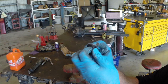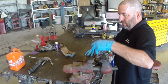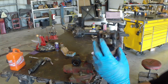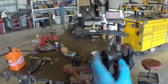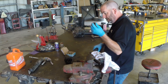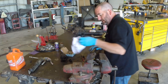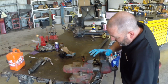One of these cups is filled with little needles that act as the bearings for this guy. You can go through and inspect to make sure you've got bad parts. This one here actually looks pretty happy looking, but you can see a little wear — those lines where it's been sitting and walking — that's probably the beginning of the end for this one, so it's bad. When handling your new one, be very careful not to spill out any needles because if they're not all there your new one won't last very long.